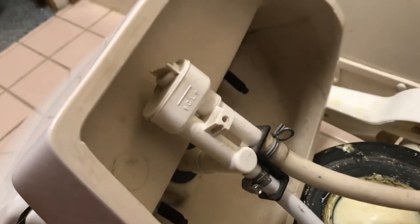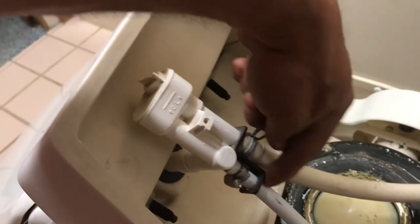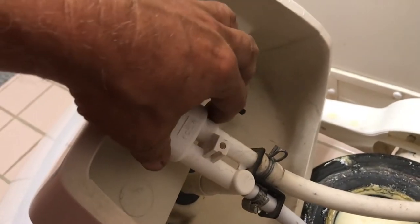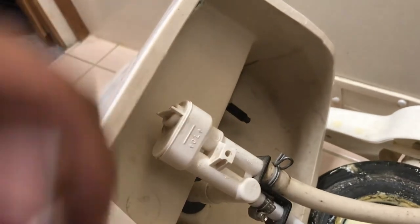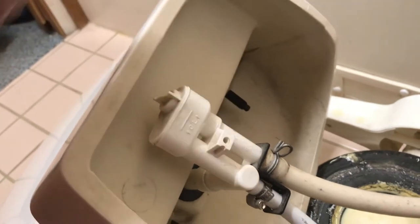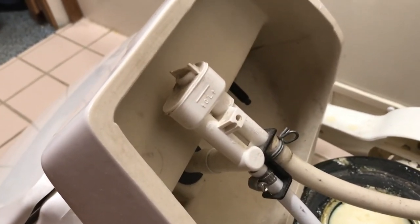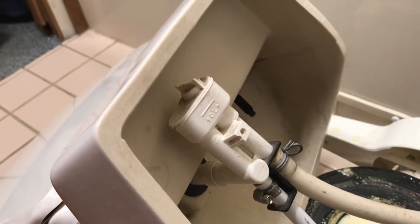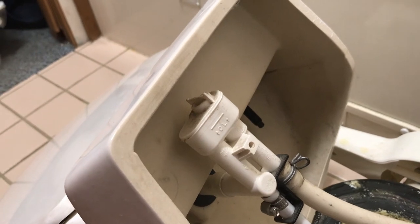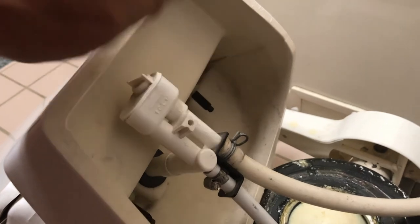Okay, this is our water valve right here. And in my particular case, I've got an extra piece on here, which is for a sprayer. So this is a nice setup because if you've got anything left, you can actually spray it out. But if this goes bad, when we first got our unit, that was bad. And it's because people didn't drain it. If you don't drain your lines for winterizing, things like that, if you're not living in it full time, then that does get frozen or the valve goes bad in there.